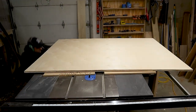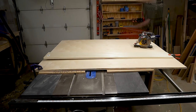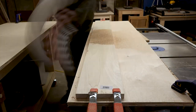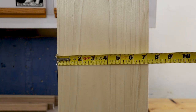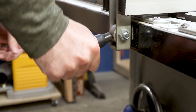To cut the plywood to a height of 30 inches, I set my piece on the workbench and table saw and used a piece of poplar to act as my fence. I decided I wanted to class things up a bit and give it a little frame. The piece was slightly over seven inches wide, so I set my table saw fence to one and a half inches and ripped it four times.